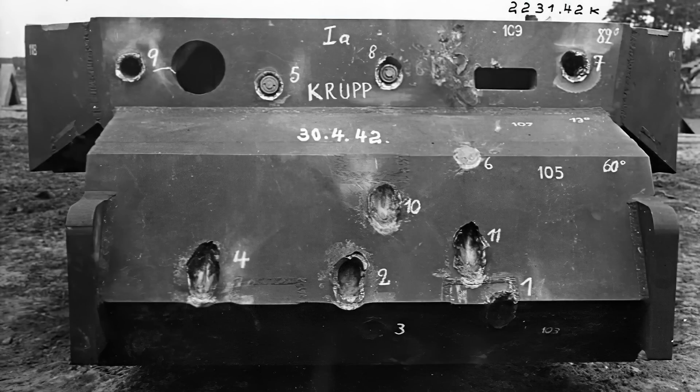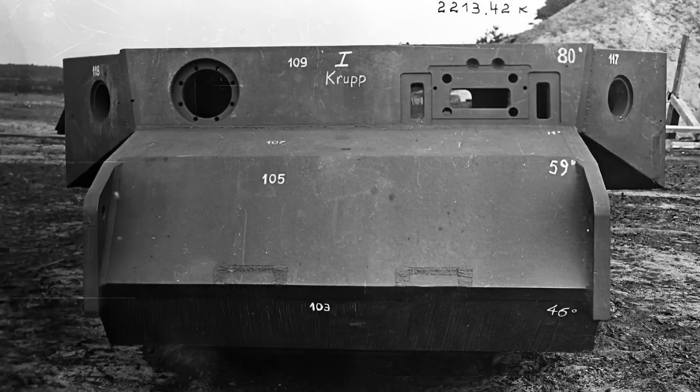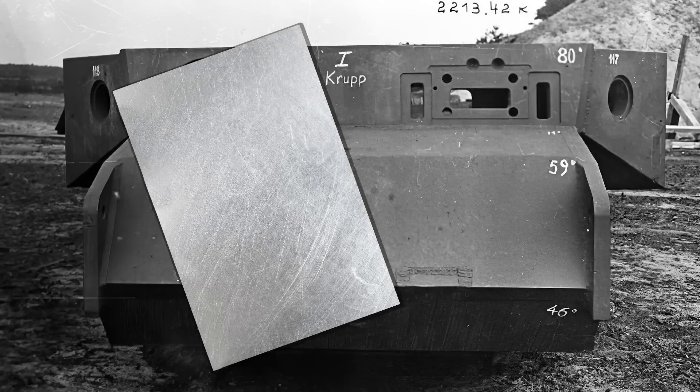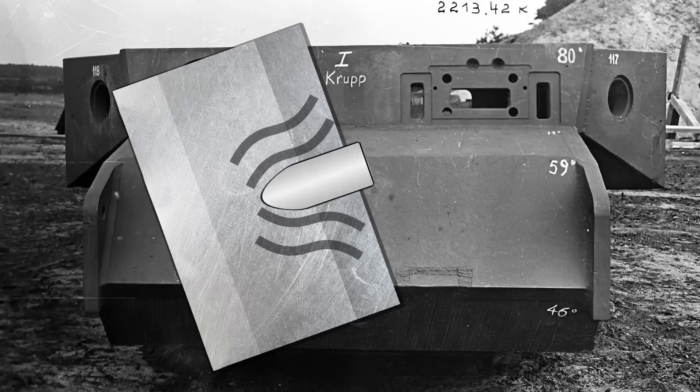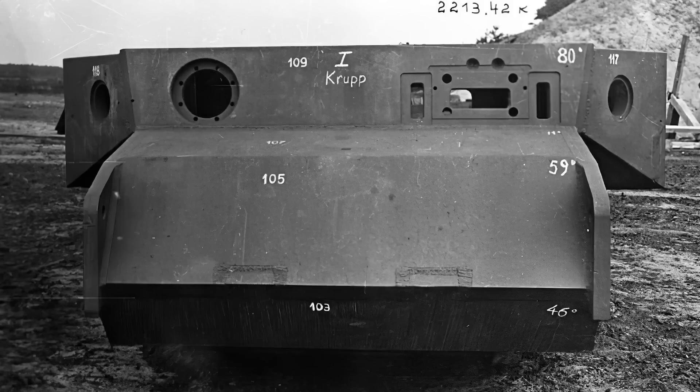To create this heterogeneous armor, the Germans used flame-hardening techniques done by using oxy-acetylene torching over a metal surface. This was not only very time-consuming but also used up a lot of gas — so much so that ballistic trials were often done on RHA armor and then the math applied after to calculate any additional effect, something that could have proved disastrous later on. By flame-treating the armor to a depth of five to ten percent, the metal would form a harder outer shell softening towards the back, creating a more ductile rear plate. To get this effect, the steel itself required a higher than normal carbon count, with the harder surface shattering armor-piercing rounds while the softer inner surface dispersed the energy to prevent perforation and spalling — in theory.